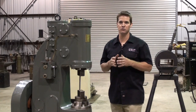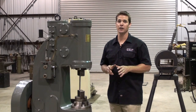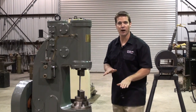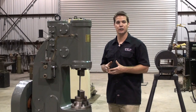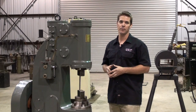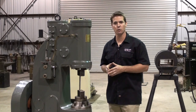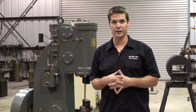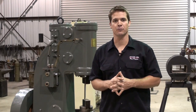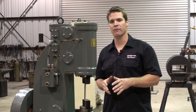There should be no tripping hazards around your hammer. Also, try to remember not to allow people to sit down around the power hammer. When somebody is sitting in a chair their head is almost the same height as the dies — if your work piece were to break or shear it could shoot out and hit them. Never rush from the forge to the hammer. Always be mentally prepared for the next step in your work piece. Forging with a power hammer is not something I would consider risky or dangerous. The most important thing to remember is to practice common sense.